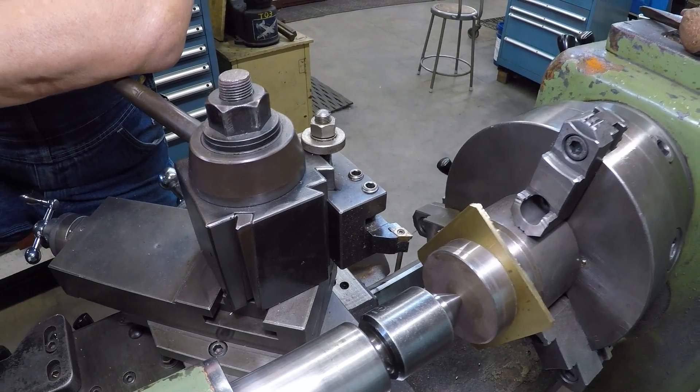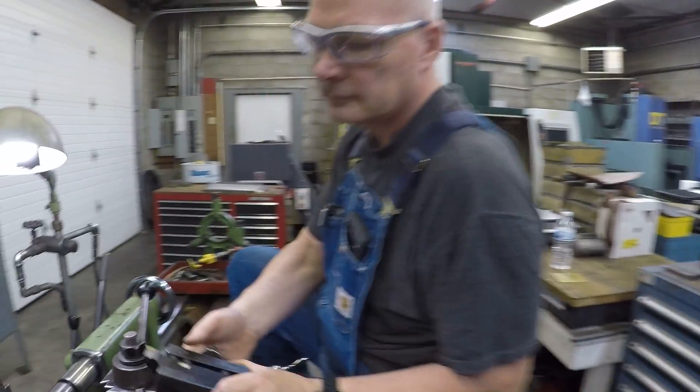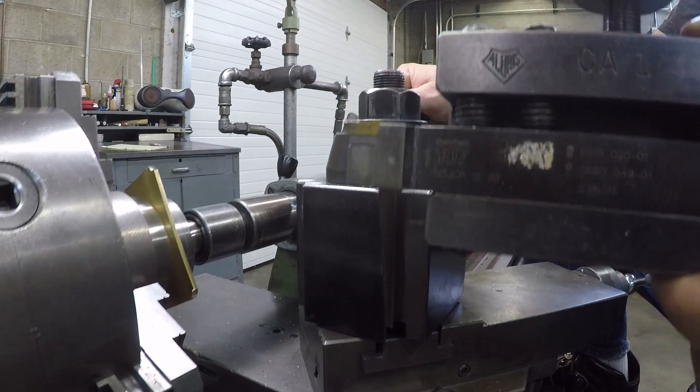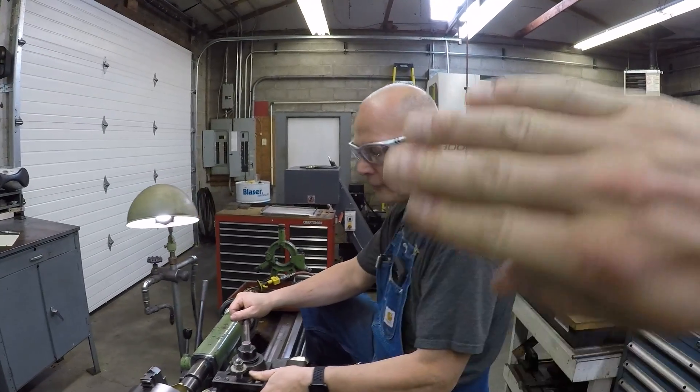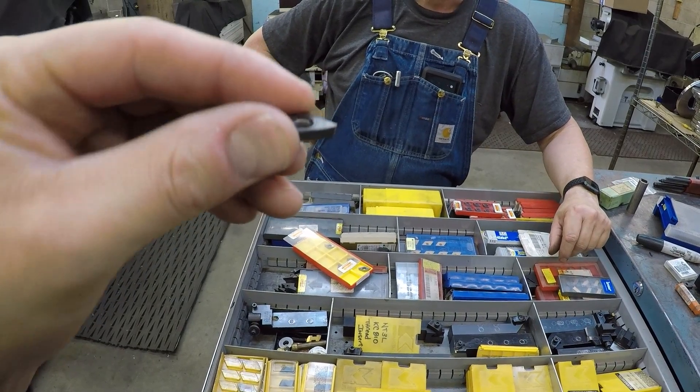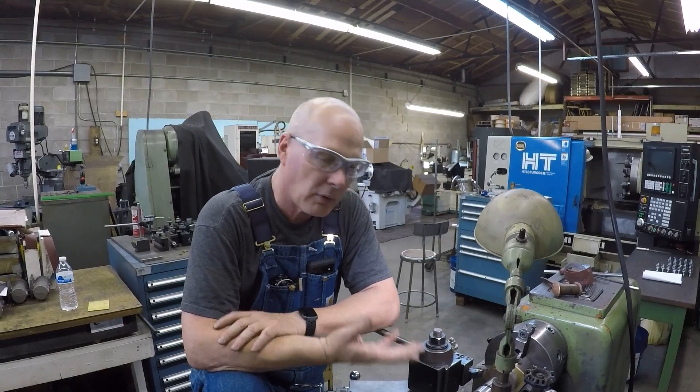You want a positive rake insert to minimize the cutting pressure and forces. Positive rake inserts tend to leave a better surface finish and have lower cutting pressure, so you can cut faster or with less horsepower per cut. The downsides are that they don't last as long because they're weaker — they have an exposed rake tip. Also, they usually can't be double-sided, so your carbide insert might only have two or four edges, whereas the negative version of the same style you can flip over and get double the cutting edges. It forms a very natural shearing action.